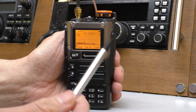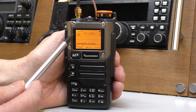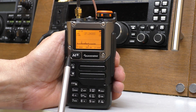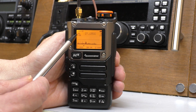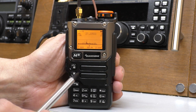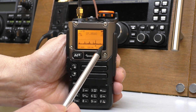I've noticed the spectrum display isn't going right across the screen — it shows '105K', meaning the 5K step we set and 100 times scan rate. By using the one and seven keys, we can manually change the step rate. If I change it down to 2.5 kHz, it should fill in the screen a little better, though it will affect the scan rate which appears to be automatic. Taking that down to 2.5 — there we go, now it fills the complete screen. It now says 200 times right across the spectrum display.